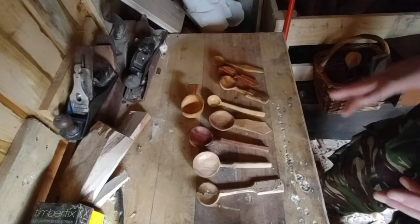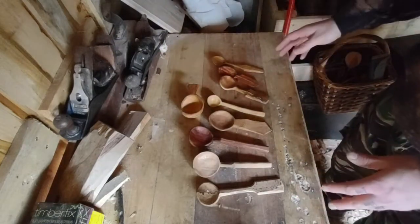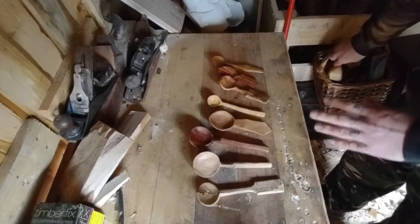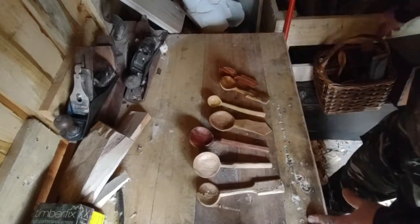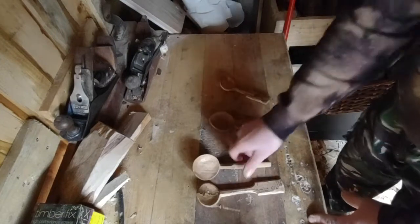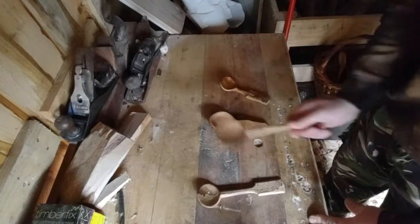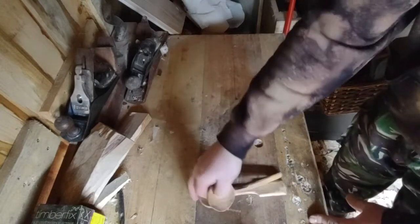To work with willow, just paint the ends of the log with a bit of PVA glue, keep it undercover somewhere out of wind, rain and sunlight, and it'll harden up over time — a little bit more pleasant to carve, not quite so stringy. Poplar I hate — I really dislike carving poplar, just horrible experiences with it. Beech, cherry, alder, linden, birch are nice. Sycamore and maple can be a bit hard for a beginner — but I'm going to be using sycamore today because it's what I've got and it's nice and fresh.